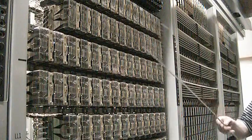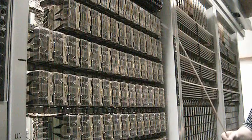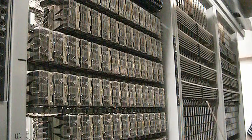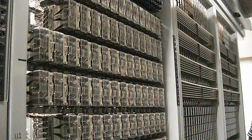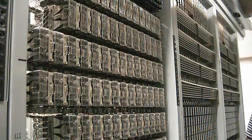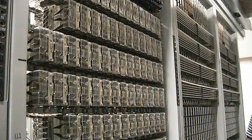One thing is, when these relays operate, this is one of the things that draws a tremendous amount of amp load in addition to the marker. One thing about the number 3 crossbar, in my idling state right now, we're drawing about 10 amps of DC power. In order to give dial tone for one customer, it takes about 12 amps for 1 second in order to establish a connection between the line circuit and the originating register. Once the information has been dialed into the originating register, it takes approximately another 12 or so amps for the marker to complete the call either within the switch or externally.